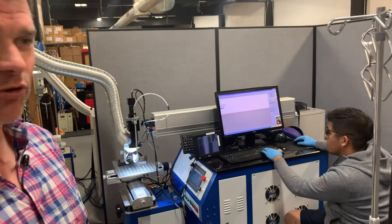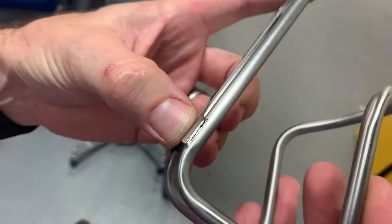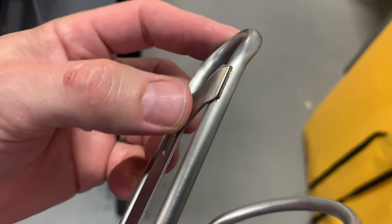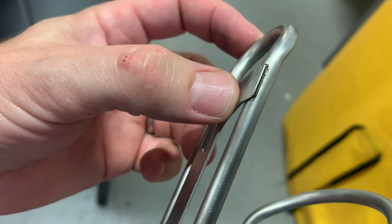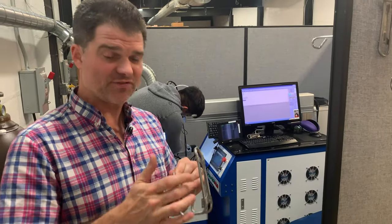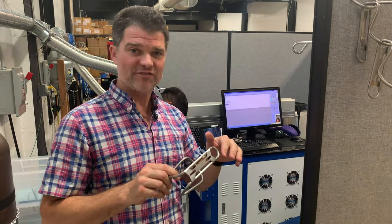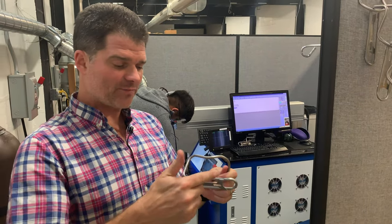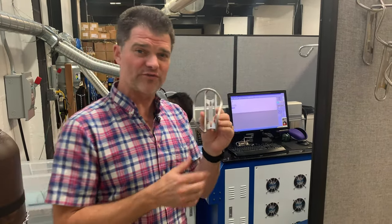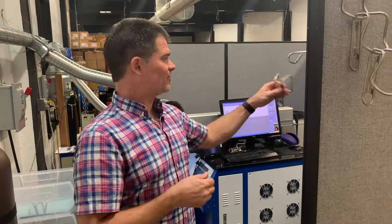You can see that real shine — that's what you want in titanium welding. It means you've been really pure in the environment. This is right off the machine; we haven't touched it with Scotch-Brite or anything else, so this is indicative of the level you're able to get straight out of the machine without any finishing. Then to make it all look uniform, they'll take it back and hit everything with a 1000-grit equivalent Scotch-Brite to give it a uniform color and pretty it up, then a final inspection, and it goes to packaging.